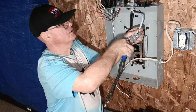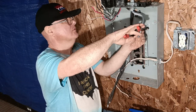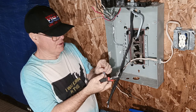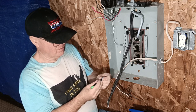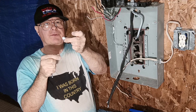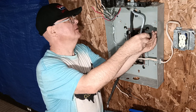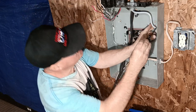We'll have to strip our conductors carefully — you don't want to cut your conductors underneath there. You also have to make sure you get that little white film off the wire. There's an undercoating of white film you want to make sure you get off your conductors too. Then we'll put our white on the neutral bar, in any one of the big holes, and make sure it's in all the way.